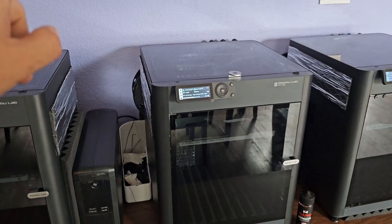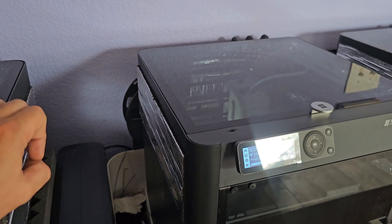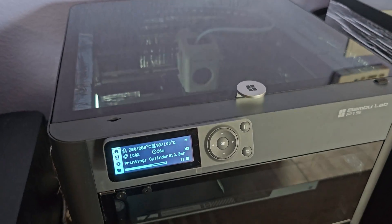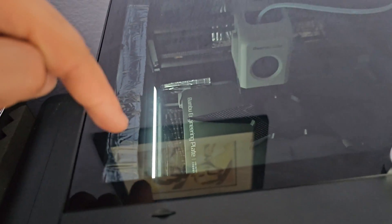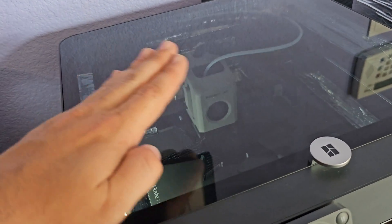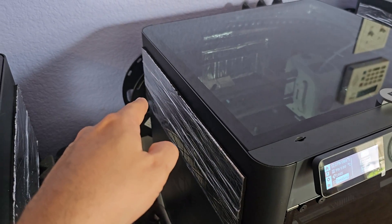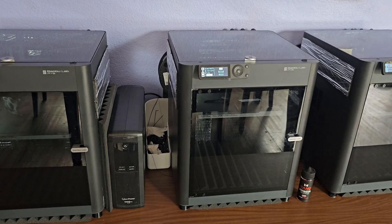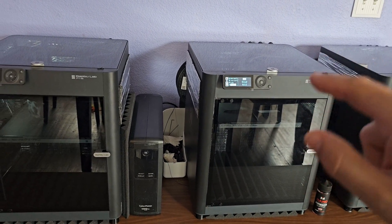Some of the most impressive features are honestly the filament changing — changing filament in this is the easiest it's ever been. In the past, all the automatic filament changing just really didn't work that well. With this one, you go into the screen, go down to feeding, then go to unload, and it'll go over to the side where there's a little lever. It'll come up to the front and hit that lever, which chops the filament flat perfectly. Once it comes out of the printer, you don't have that heated-up glob that stays in the nozzle. You just push load and put the new roll in. All of your rolls coming out of this printer are going to have perfect cut ends and you can just wire them up and stick them back in. I've never had a jam loading or unloading this machine — it's been beautiful.